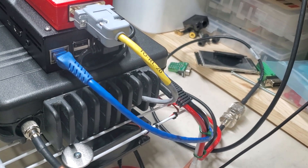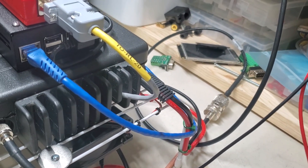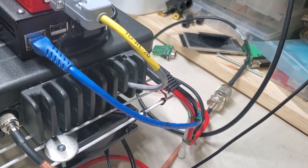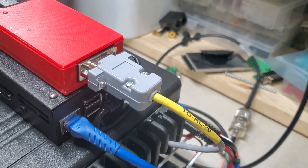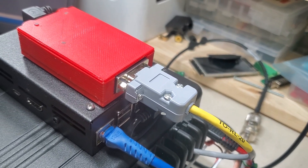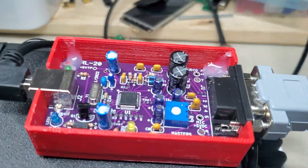This gray cable is shielded multi-conductor, coming from the bottom of the radio with a flat Motorola style connector. It goes into a DB9 male connector, and then it mates with a DB9 female connector on the RL20. Let me take the cover off so you guys can see.